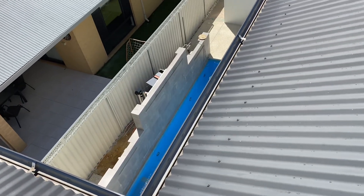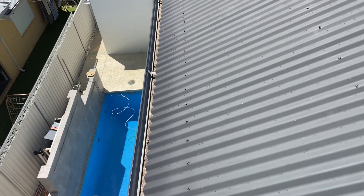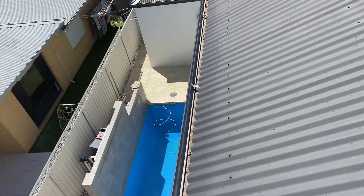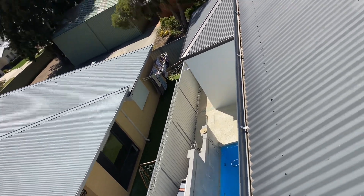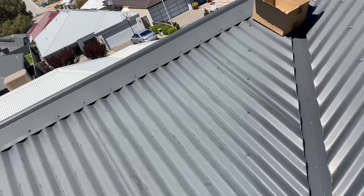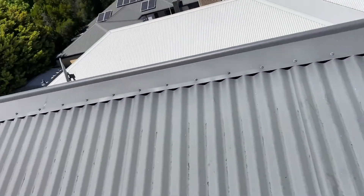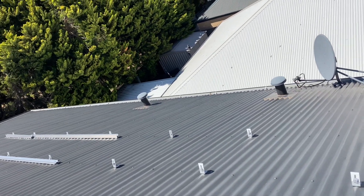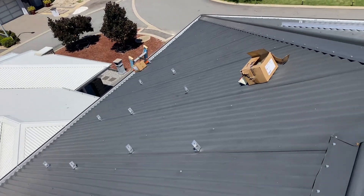And from the edge of the tin sheet — this is a two-story home, so you need to allow for the height of the building. The wind can be a lot stronger towards the edge of the roof than in the middle. Australia alone has three or four different wind regions, so you need to be aware of different zonings. For me, I go five screws apart and 200 millimeters from the edges, and that covers me for all my installations whether single-story or two-story.